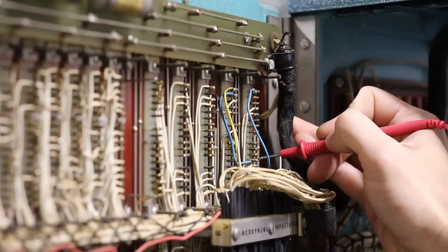This becomes very important because the typewriter I have is an ANC typewriter — it has to plug into that specific relay box, which Bob sent over. If this is not an ANC machine, that box doesn't talk to this machine, the typewriter doesn't work, and we've got some head scratching to do. Right off the bat — no. ANC machines came with an additional indicator light up here, and this one doesn't have it. However, early numeric machines were often converted to ANC in the field by engineers upgrading the customer to a newer typewriter.